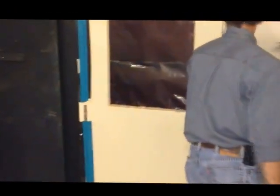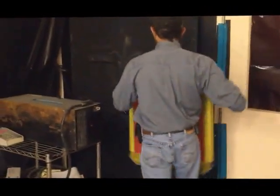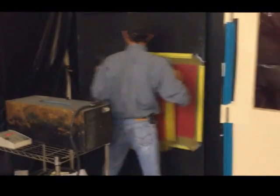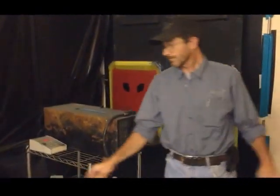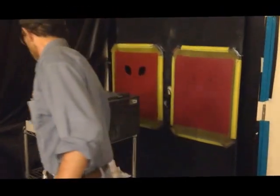He's going to collect the two screens, put them in the pre-soaked tank, go get two more, and remove the exposure light source — we've moved it quite a bit closer. We used to do four at a time, but by moving it closer and optimizing it for two, we cut our exposure time by three quarters.